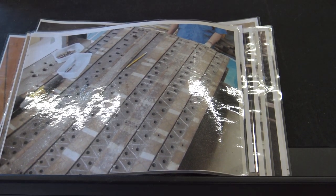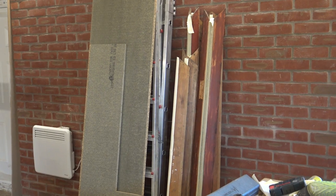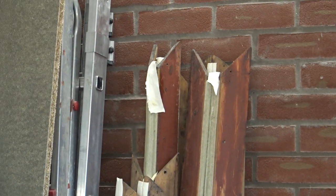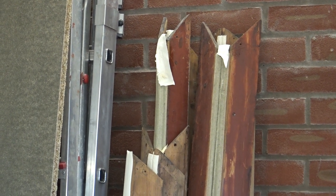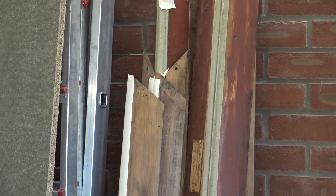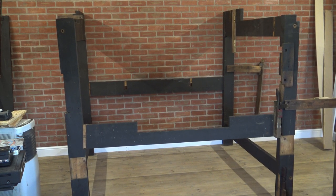We've got to a stage where we've put the building frame together. Just before we go over that, I'll show you the ribs — they're lurking against that wall, ready to go. We haven't tidied the edges up because when I put those together and put the gussets in, I'll trim them exactly how I want them later. There are eight ribs, done and taped with leather on both sides. Here's the building frame — you'll see the tenons are gaping as there are no coach bolts in yet.